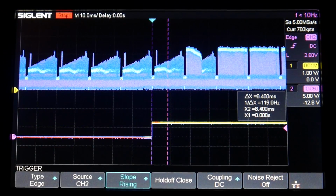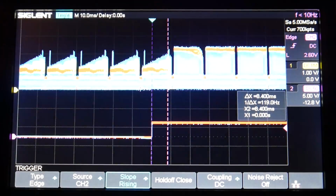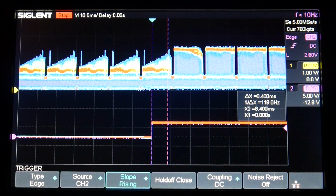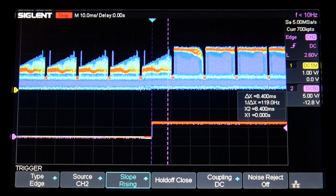Alright guys, so let's go ahead and take its first measurement. We are going to take when the LED boots up or just turns on. Now, this time I'm not listening in on the screen of the LCD with the photoresistor. I'm doing the exact video line, which would mean the exact line that's going straight to your VTX. What is the latency from the camera down to the VTX?